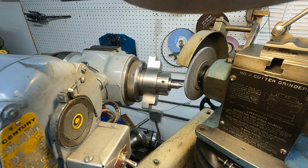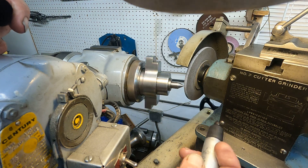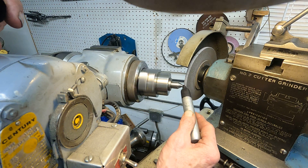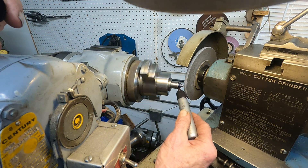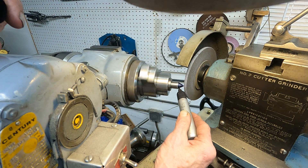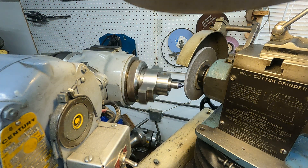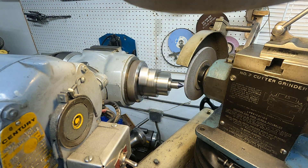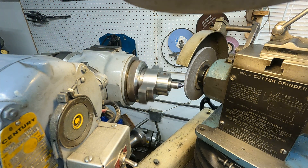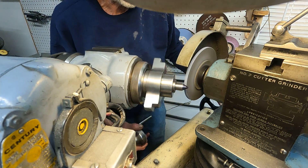It's running out about — I've got adapters in there, a cheap adapter and a beat-up center. I don't know where it came from. I got it adapted down to Morse Taper 2. I'll put a little ink on it so you can see. Now I'm going to go around to the other side so I can see it a little better and operate the controls. Start that wheel head and grind that thing true.